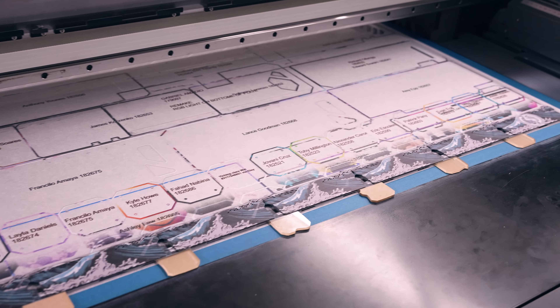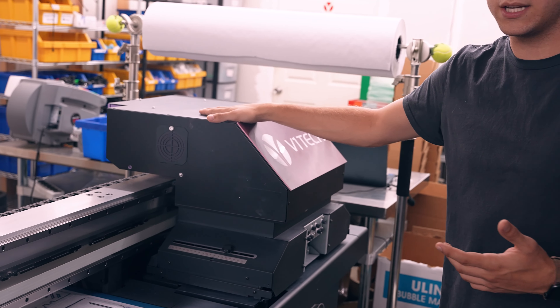It gets really stressful printing sometimes — this is obviously high dollar equipment here. What we run into when printing is getting exact measurements, especially when we do things outside of our usual pre-cut back plates. Those are all the same height, so we know what height to run them at and can set it to the exact millimeter. But when we do things like RAM covers where we have to custom measure them, these ones sit a little tall on the back so we had to lean them forward. They're metal and can warp a bit, especially using the heat gun and having to pry them off. I did a good safe above measurement because if we do a head strike on this, it's a lot of money to replace any print heads.